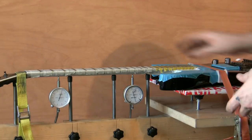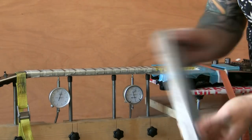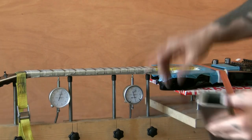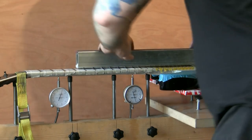Well, welcome back. I'm just about finished leveling the frets. I've been over with the 240 grit. Just about to finish off with the 400 grit, which is a lot smoother. I've just gone across the top again in pen. And once this pen's removed, we know we've got all the frets level with each other. Shouldn't take too long.